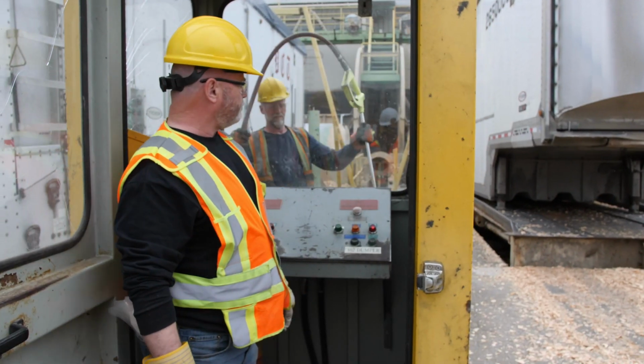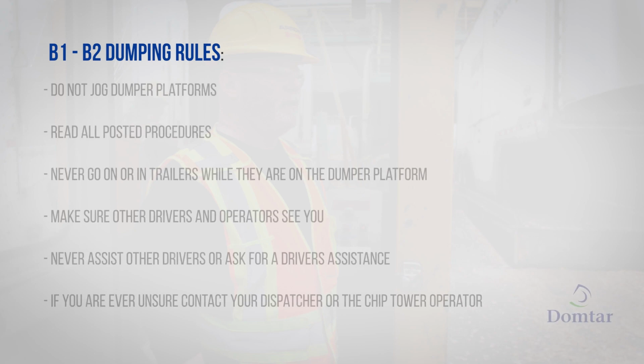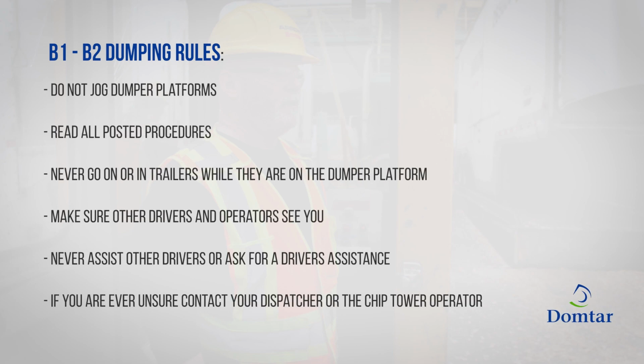Before we go into the actual dumping procedure, I'd like to go over the important dumping rules. Never jog the dumper platforms using the raise or lower buttons. Look for and read any posted procedures, notifications, or segregation lists provided in the booths to ensure that you are following appropriate procedures. Never go on or in trailers while they are on the dumper platform.